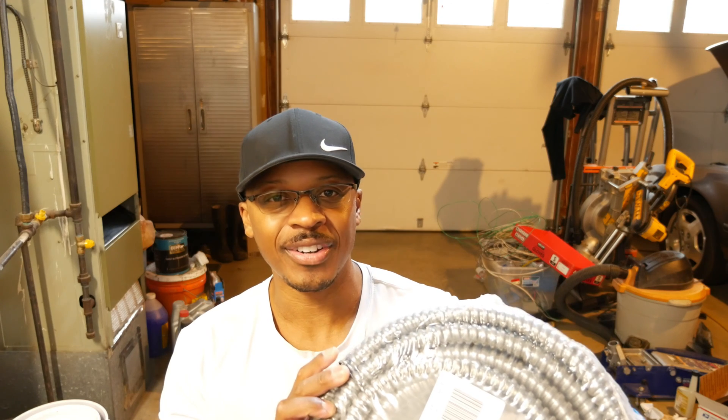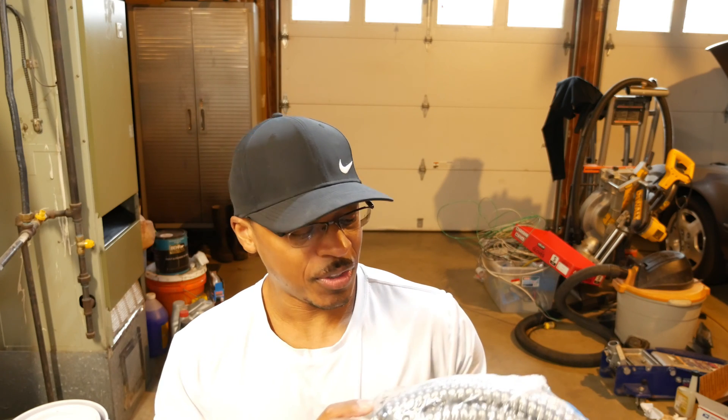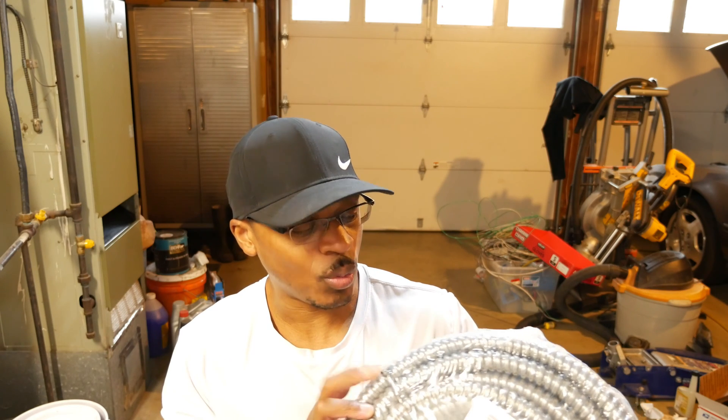Which is this stuff here. You probably saw that I installed some conduit in the garage — that was EMT conduit, which is a more rigid form. This here is flexible metal conduit, one-half inch. What I'm going to talk about in this video is how I decided on this particular size of conduit and how many wires I can actually put in it.